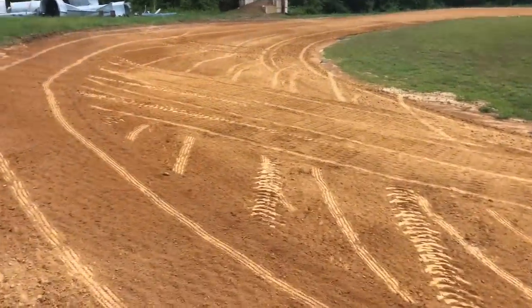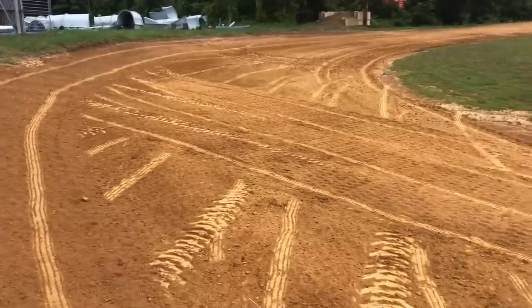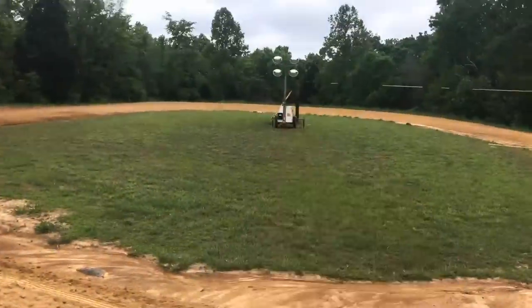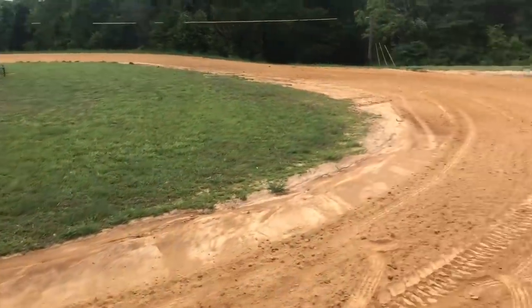Guys, I got her power raked. You got a lot of the major ruts filled in as good as I'm gonna get with the power rake, but it is dry. This end here is not too bad, but that end down there is nothing but bug dust powder. So I guess the next step at this point is gonna be a couple thousand gallons of water and get enough moisture in this dirt that we can get it compacted and graded, because go-karts don't have suspension and a rough track's really hard on the bottom end. So we're gonna see how good we can get her.